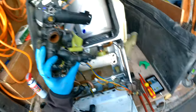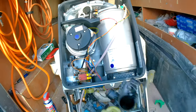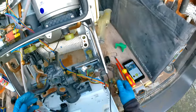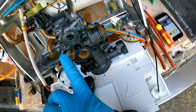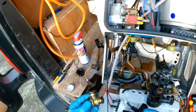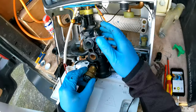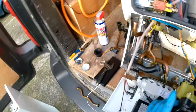This is how your new return manifold will come. Start reassembly by greasing everything up. Reuse the washers if you didn't get new ones. Pop the PRV back into the manifold, make sure it's in properly, and secure it with the clip. Give it a push to confirm it's not going anywhere.